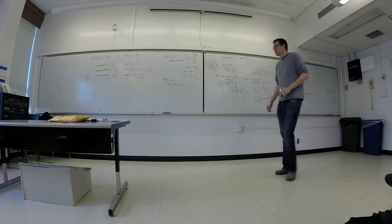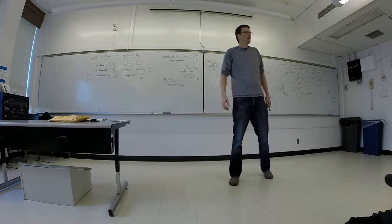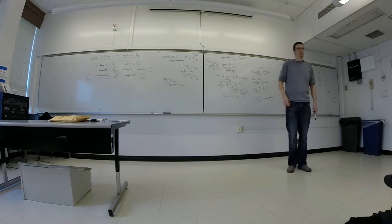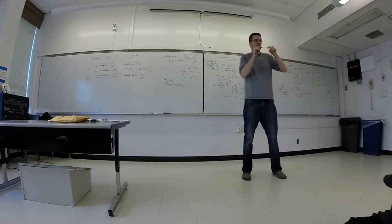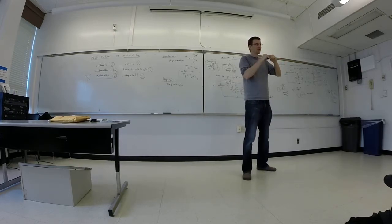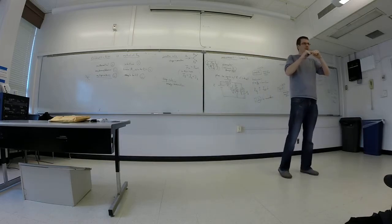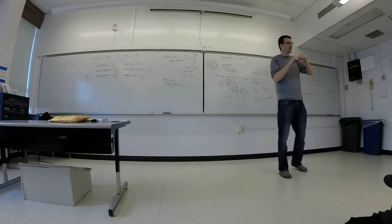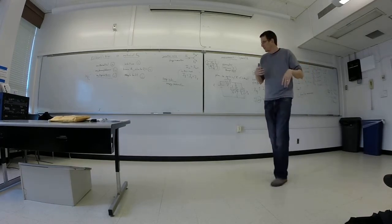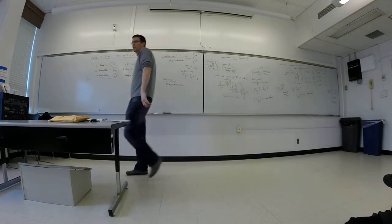And so basically the feature of it in this context is that it's impossible to have two different voltages at a given point, right? If we know that it's 5 volts at this point, it can't also be 3 volts. That's contradictory, right? So whatever voltage is at a given location, that's the volt. That's how much energy is available per charge. You can't have two different amounts, right? That's mutual. What do you call that? Contradiction terms. Mutually exclusive. So yeah, exactly. So that's what the loop rule makes sure.